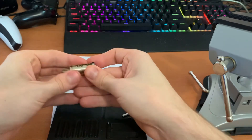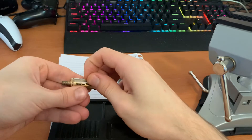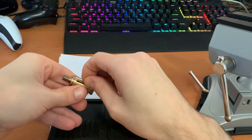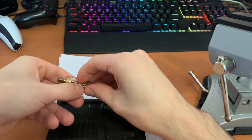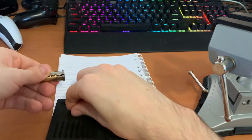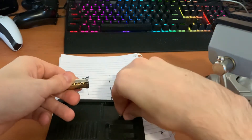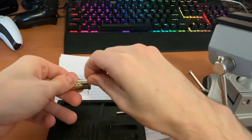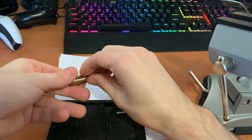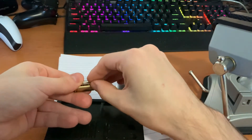There are some interesting points about the sidebar. Sidebars always have a little pin with a spring that keeps them out. When the sidebar clicks in, that pin actually goes all the way into the lock, serving as a bit of a passive pin.